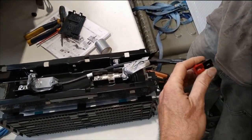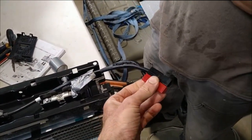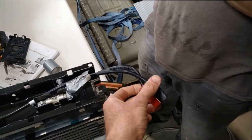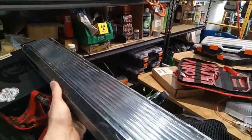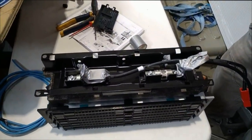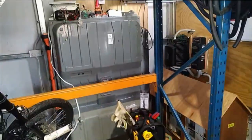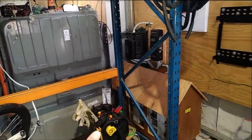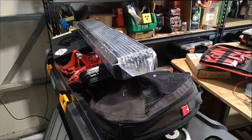The reason I was in there is not because I was being a fool. It's the kind of thing that, according to the distributors, you might have to do, because apparently they disconnect this to stop it from self-discharging when stored in a warehouse. To get into where this is, you take off this cover, then unbolt another piece, and then you're presented with this. Not beautiful design. The Nissan and the Tesla both have insulation even when you're deep in the case, so you can't do dumb things like that and get bitten.